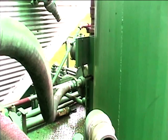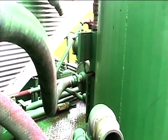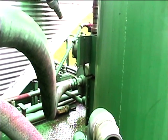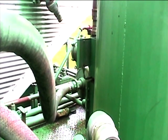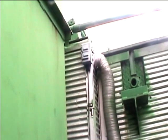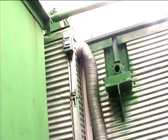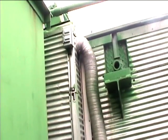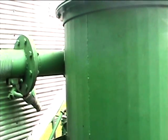In addition to providing LP to the Power Flame burner, LP also burns in the thermal oxidizer unit, which burns the vapors. This is the vapor collection unit at the top of the auger chamber. Vapors are sucked through this piping to this blower, and then they go into the thermal oxidizer.